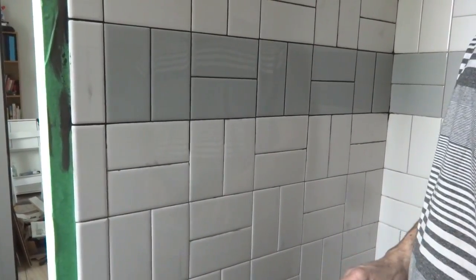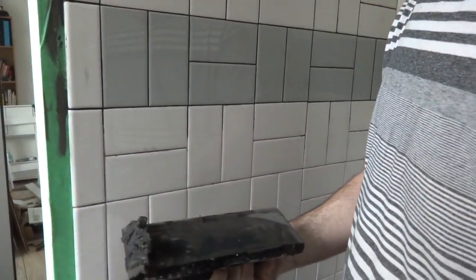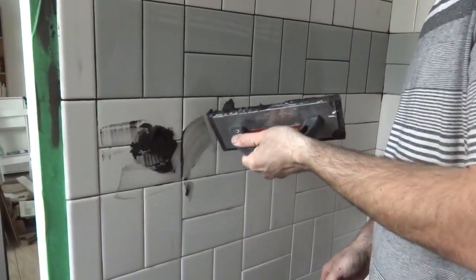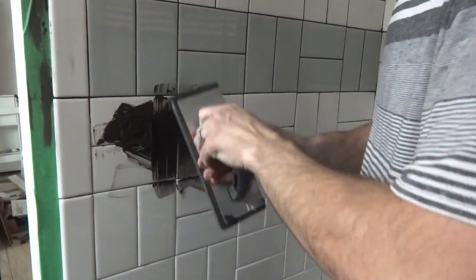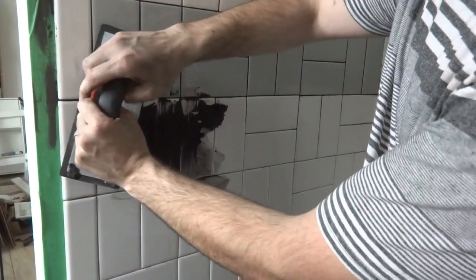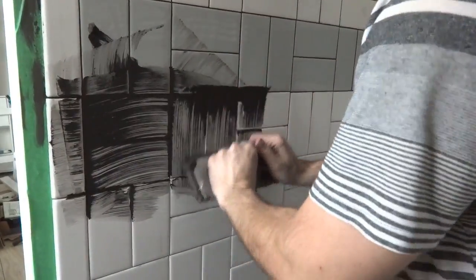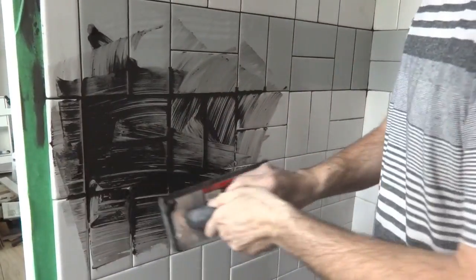I got a little head start here to get the hang of it again since it's been a while. You put some grout on the rubber foam float and squeeze it in real tight. You want to smooth it on at a diagonal angle, because if you go straight it digs into the lines and pulls too much out. Going at a diagonal, it floats across all the lines and makes them nice and even. You just have to really work it — it's pretty messy and will look terrible at first, but it cleans up really nice.